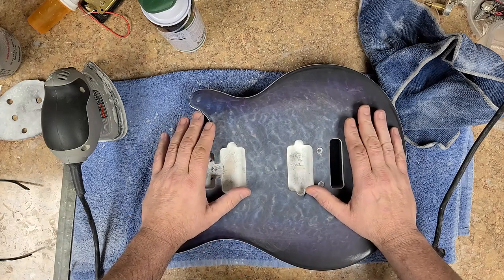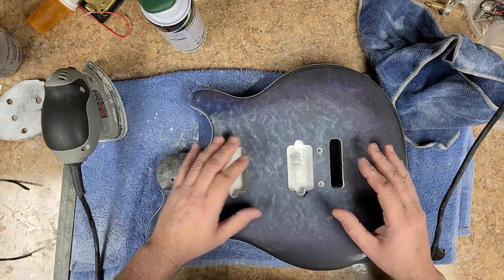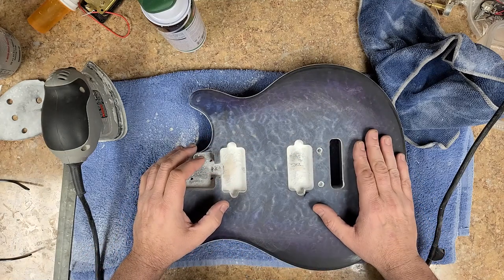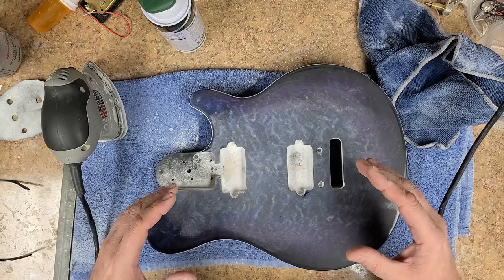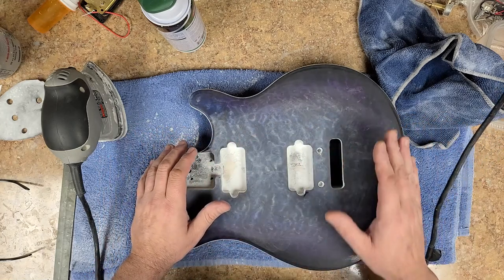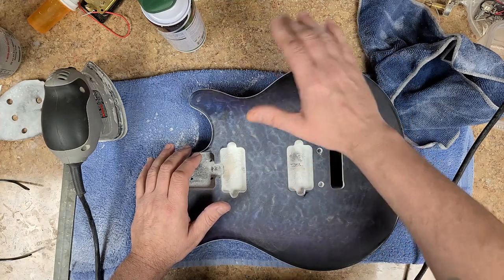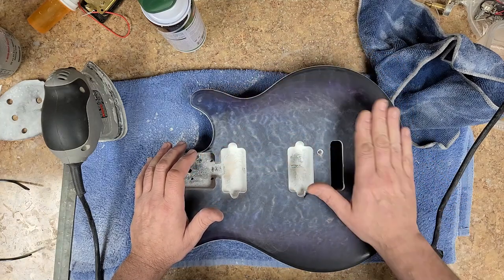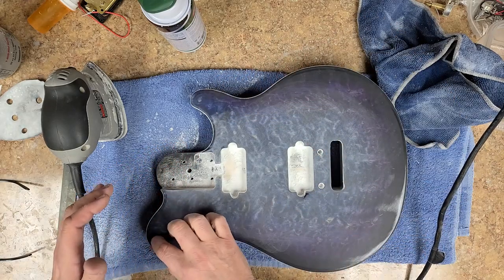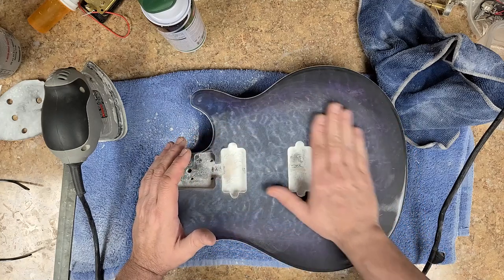So what happens when you do the epoxy resin? If you're doing a large tabletop and you're using the epoxy resin that's for countertops and tabletops, if you have a large area and no cutouts that you have to mask up, it'll pour and self-level really nicely. Around the edges it's a little bit thinner because it has to fold over, like I do around the edges of the guitars. I don't mind that, but this top I want to make sure is nice and flat.